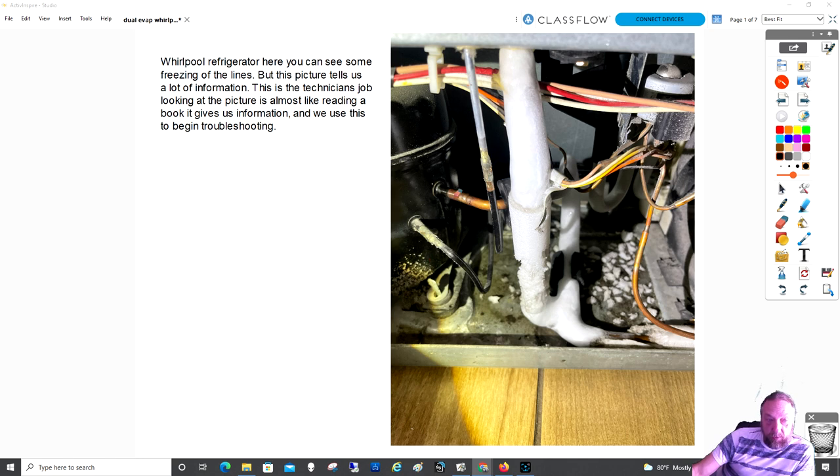But if you look at the compressor — does that look like factory braze joints, or does it look like someone did a compressor job? That's pretty much factory; it doesn't look like anybody has done any work on this compressor whatsoever. There was no access valve on the system. So yes, it's an indication of overcharge, but if there's no valve and the compressor is factory, how did it get overcharged? This is not a brand new unit — it's been here for a little while, so it didn't overcharge by itself.